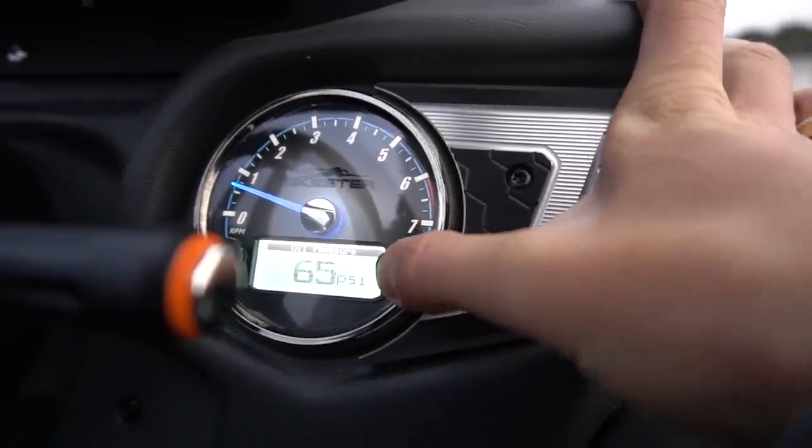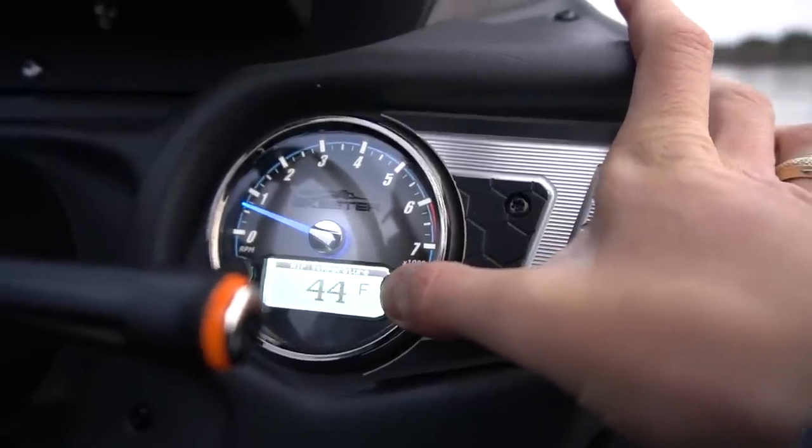There goes Austin and we are beginning our idle process. On the right side of my dash I can check water pressure, battery voltage, engine hours, fuel level, miles per gallon, trim position. We're at 0.3 hours on the engine right now — it had 0.2 hours from the factory. In the first hour we have to do 15 minutes of idle speed, then nothing over 3,000 RPM for the rest of that hour, all the way to 1.2 hours.